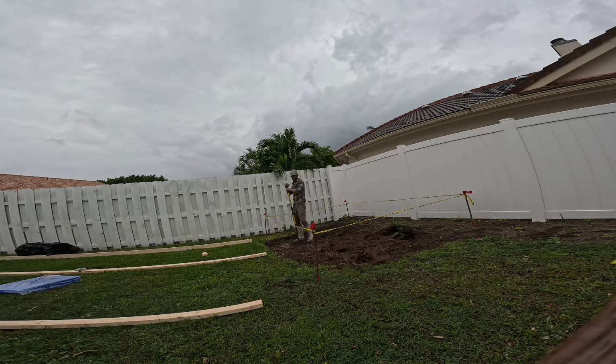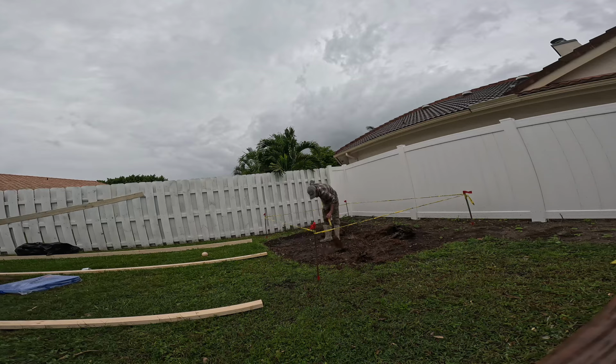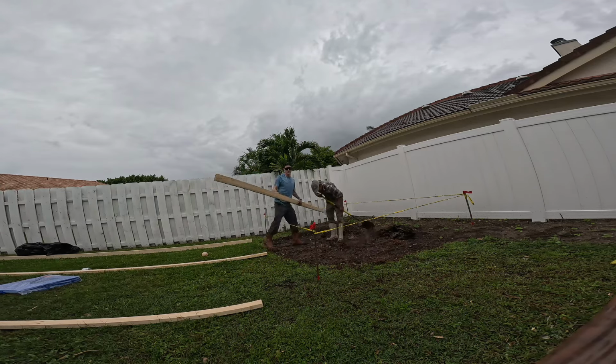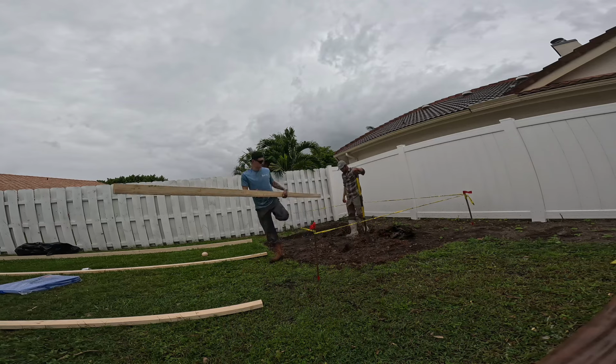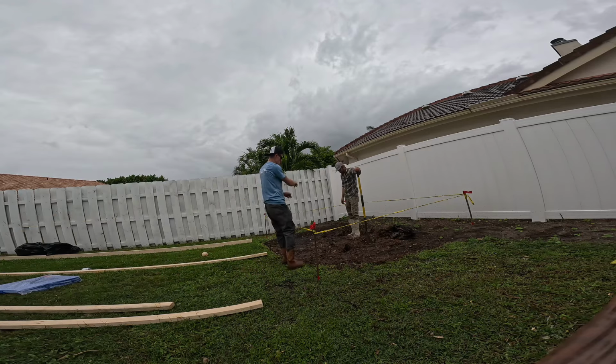It should be damn near close to the elevation we should be at. We just gotta rig it around. Let's see. I'll put the board from line to line. And the top of the red tape is where I made the grades yesterday. Once we get it all formed up, I think I'll run string lines and see how much area we got to take out.